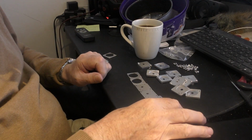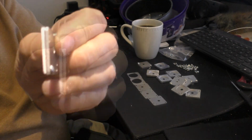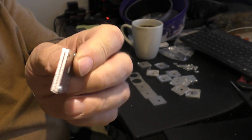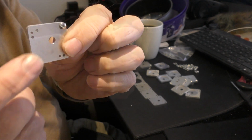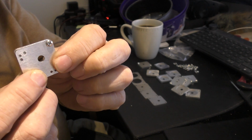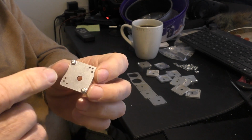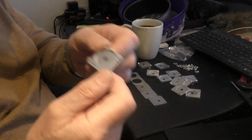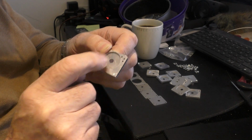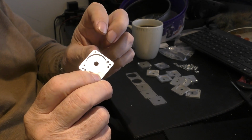The first part that we have to do was to put them together so that they look like a mirror holder. 2 pieces of 2mm screwed together. One of those screws is there permanently, the one on this corner, and the other one is a temporary fix, because we have to hold this together solidly so that we can then tap the holes that are in the corner. And in fact the CNC version of this has got 3 holes in it, and that hole only, not this hole here, because you don't need that hole if you're making it from solid.